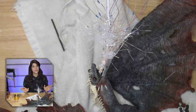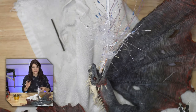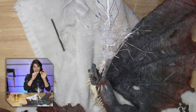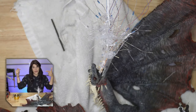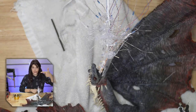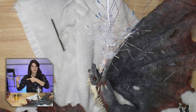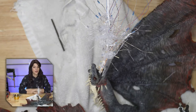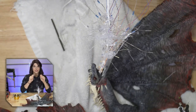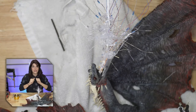You know, they're going to be totally hidden. They're going to be hidden enough. The original idea, I think, is more clean and textbook, which is combining the wires as they come in contact with each other. So you're only ever running one wire and all the wires are sequentially tapping in to that wire. It doesn't have to be the same wire with all of them tapping in, as long as they're sequentially tapping in to the longest wire. The problem there is that it creates a lot of junctures that then start moving and can snap off.